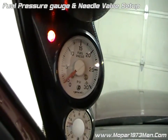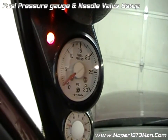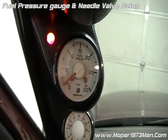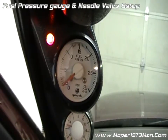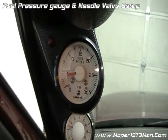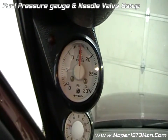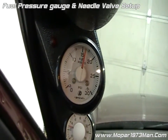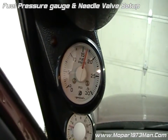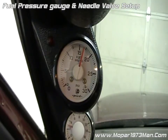I'm going to show you approximately what your setting should be looking like on your needle valve when you bump the starter, to show you how fast the needle rises on a fuel pressure gauge when it's set right. Notice it takes just a little bit of time for that needle to go all the way up to its full span. This will protect the gauge from being beat to death by the water hammer.